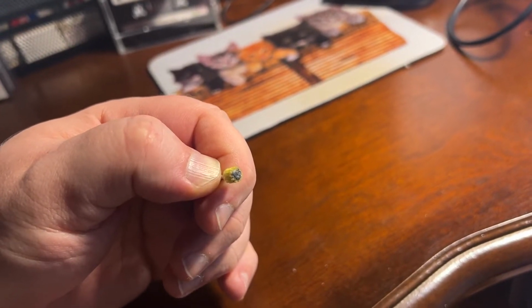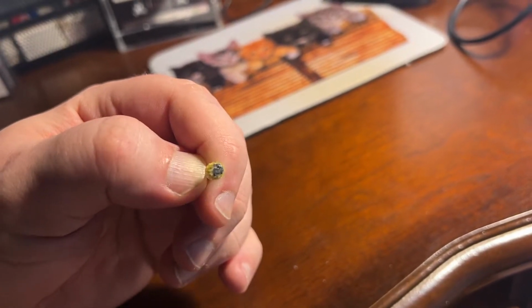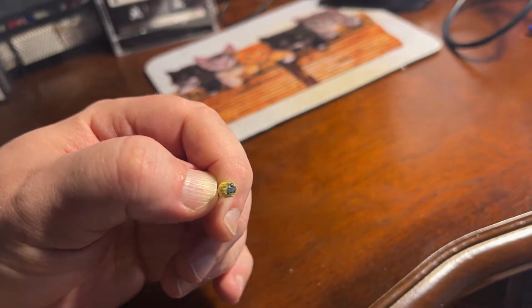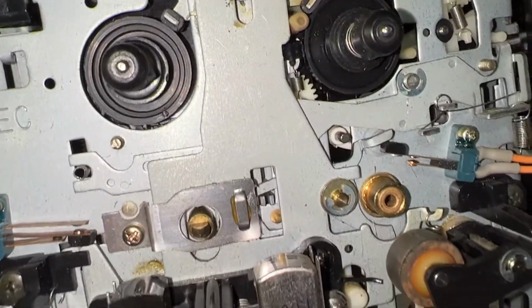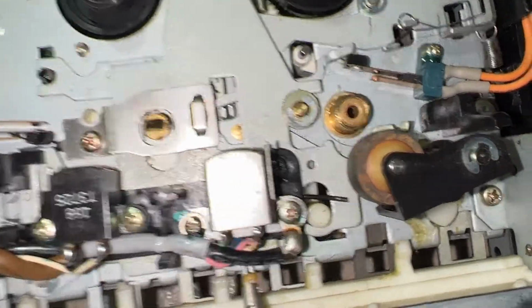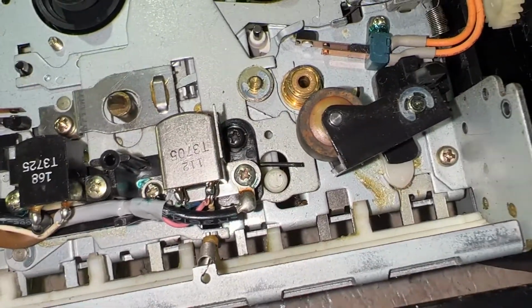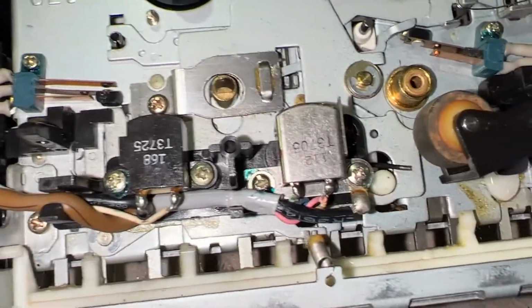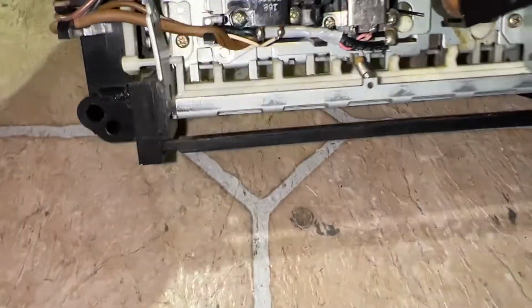Now that said, I'm going to investigate seeing about 3D printing this gear to make replacements for this. All right, now I got it installed successfully, and even with all that tension on the spring, it's holding just fine. This is how it's supposed to go right there. That's how it keeps that gear from engaging. That spring has to be just like that. Rerouted the wires. Now I have to reinstall the push keys, levers.